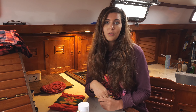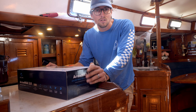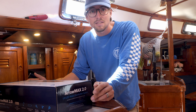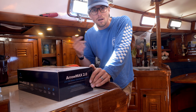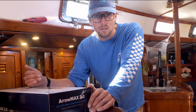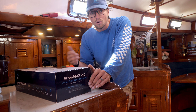One of those things is installing a UV filtration system. Today is the day I finally get to install our Acuva water filter. This isn't just a normal carbon or micron filter — it's a UV filter with a UV light inside its own little housing that the water passes by. When it's on, it's burning off anything less than desirable in your water. This is not a big unit, so it's really just designed for drinking water. I'm actually going to plumb this in with a foot pump rather than the pressure water system, so that if we ever lose power or a pump stops working, I can still drink water — a foot pump will always work if we have water.